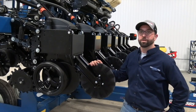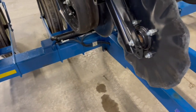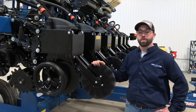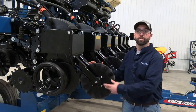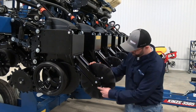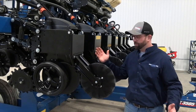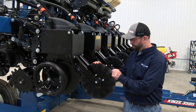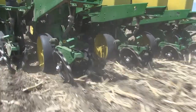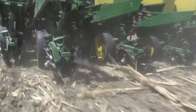As far as the coulter is concerned, we firmly believe it to be a necessity. It takes stress off the seed blades and gives a more mellow path to the surface. When we run into problems, it's with maintenance and keeping them adjusted. The majority of these have way too much adjustment range — some even a couple of inches or more. This is a 16-inch blade brand new, and with the lower notch, we could run it down into the 12.5–13-inch range, which is way too small. The blade is very thin at the edge and gets thicker toward the center, so as we wear it down, we lose our cutting edge and start hairpinning trash into the trench instead of cutting it and clearing the way.